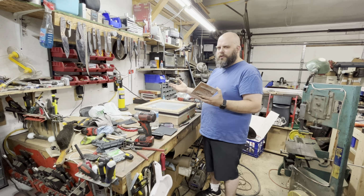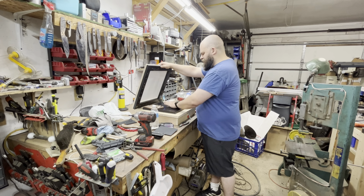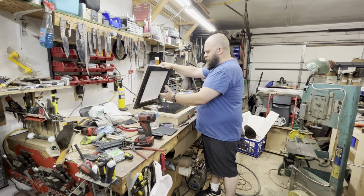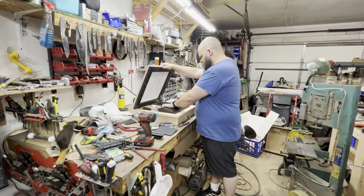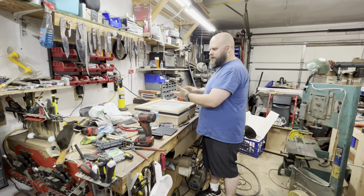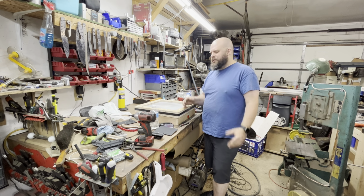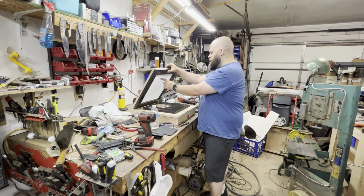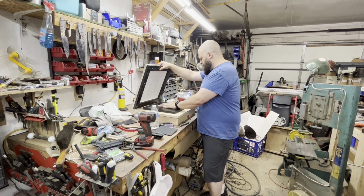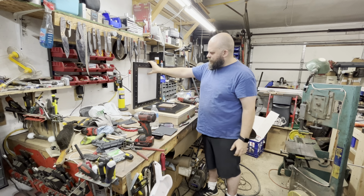Say you're doing a taco or a fold over style of sheath. I've read about how some guys just put a piece of foam, like kydex or PVC foam, down here, fold it over, put your assembly in there and then close this and form it that way. I'm not sure how evenly that works. It's not something I've tried, but this definitely, in my opinion, works best on a split mold or a split die for your forming.